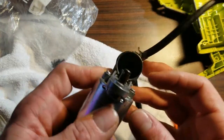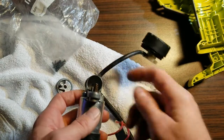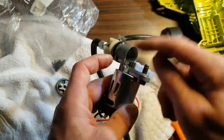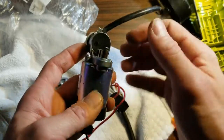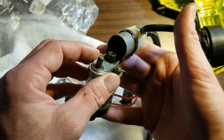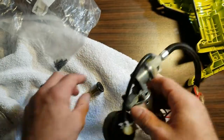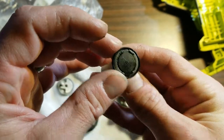What I found is that this o-ring is just lacking lubrication. On the inside, I've already cleaned this out and need to re-lube it. You're going to want to clean it out with a Q-tip — you can use some denatured alcohol or carburetor cleaner; just spray the Q-tip a little bit rather than spraying it directly in. Try to clean out all of the old oil that might have metal shavings on it, and then clean up anything else you see.